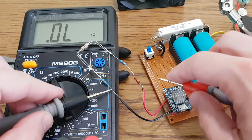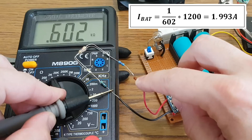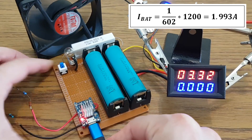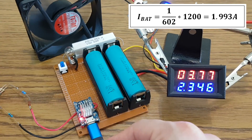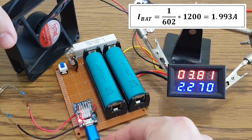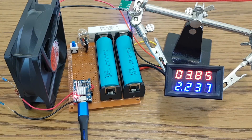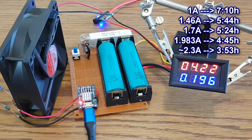Let's see how far we can go with this module — 600Ω from this contraption of resistors. Will the IC blow up? No, it works with more than 2A. I'm pissed, I wanna see some sparks! But my wish is not fulfilled — the charging is completed at around 200mA.